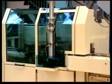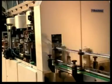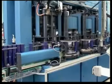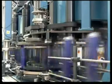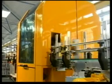In other cases, just flanging and seaming may be needed. Whereas for aerosol cans, the modules for necking in, flanging, bottom seaming and high cone seaming are used. Any combination you require. The options are limitless. Each module can also be used as an individual machine.